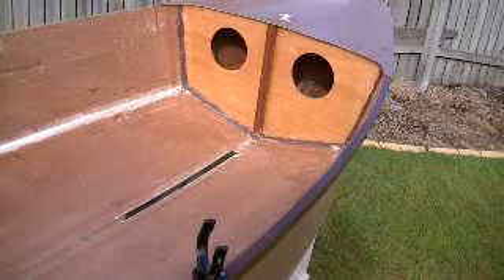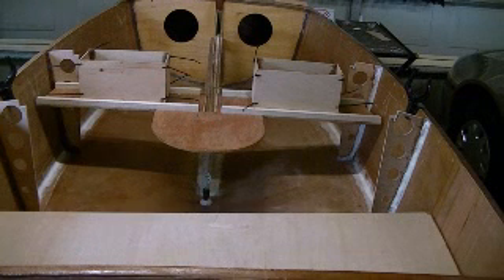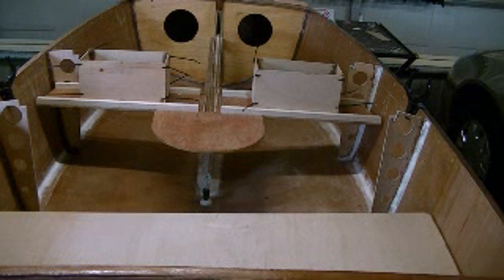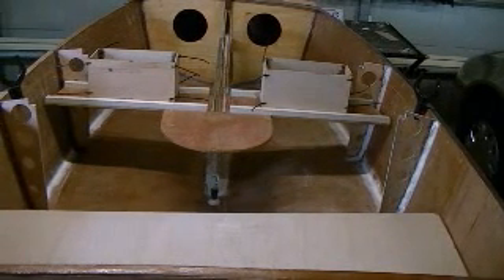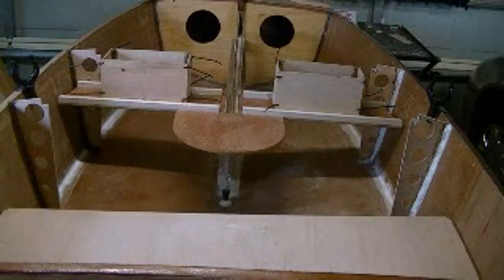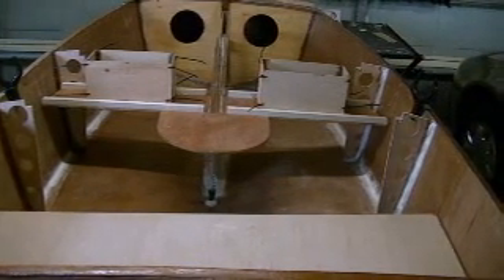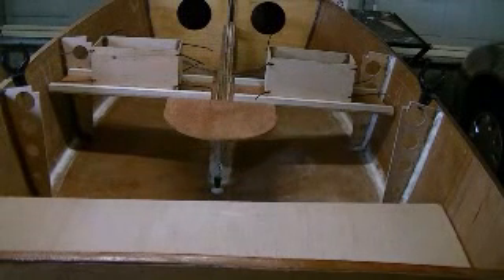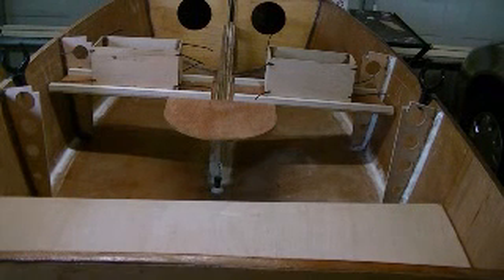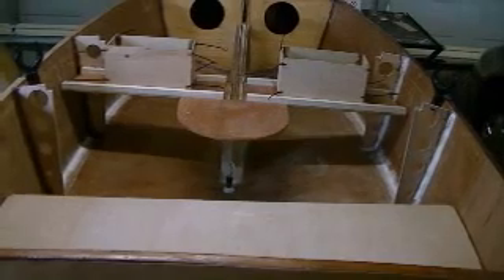Now we'll attempt to put the centre board — the fin case — in. I've just put together two little storage compartments that are underneath the middle seat. The middle seat is upside down while I'm working on these. They will be watertight and will have round circular hatches — an area where you can put your keys, Rolex, bungs. You'll also notice I've fitted a little venturi; it's a simple little elbow and you see the black bung there, a far cheaper option than some of the professional ones and it will do the job just as well.